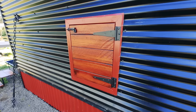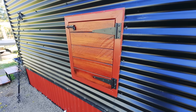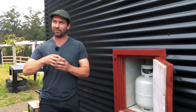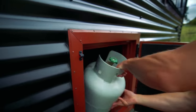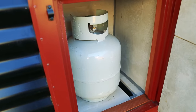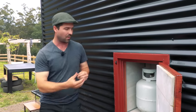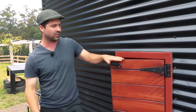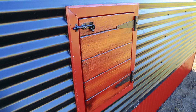This is a controversial fireproof measure — a fireproof door with a gas bottle inside. A common problem with regular houses in Australia is that gas bottles are positioned right up against the house. New regulations require them to be 10 to 20 metres away so that if they explode they don't ignite the house. Being a transportable unit, you can't pipe gas 20 metres away, so there's a standalone fireproof box with a vent at the bottom to let any escaping gas out. Timber door, compressed sheet — pretty tight.